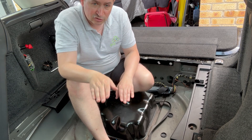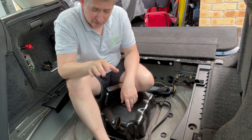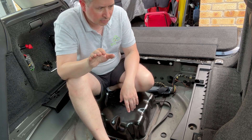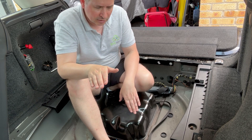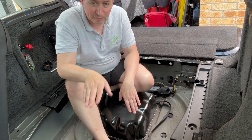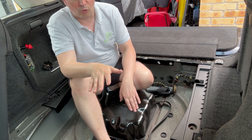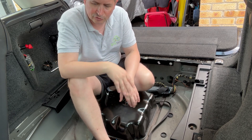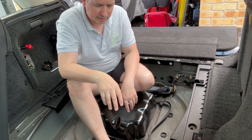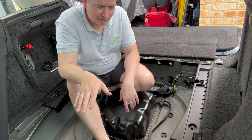Because of that, using the software I can lower it. I felt like the front left shock more than anything else was getting stuck - that might be because it's old, not used to sitting in that high position. So using the software yesterday, I dropped it by 39mm, which is the most I can do on the front, and matched that on the back - also dropped by 39mm. So the car's now sitting about 24mm higher than standard. Immediately it seemed happier - it seemed to handle better, and it didn't cause that purge problem. That doesn't mean the purge problem's gone away; it just means the car is lower and not getting stuck at that height.